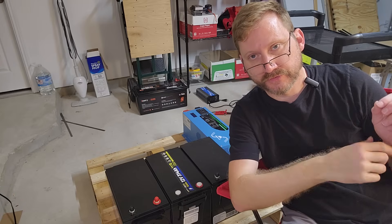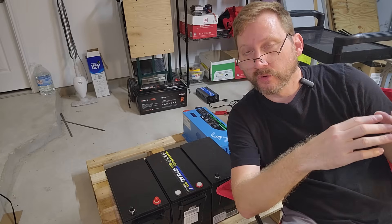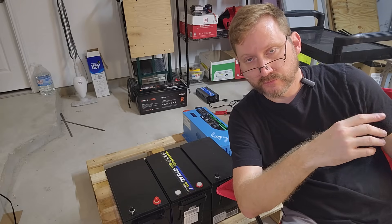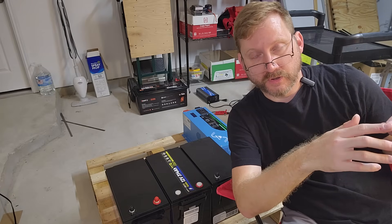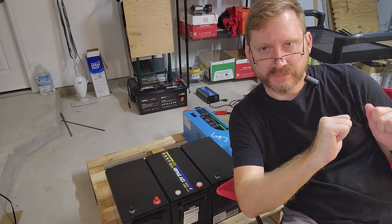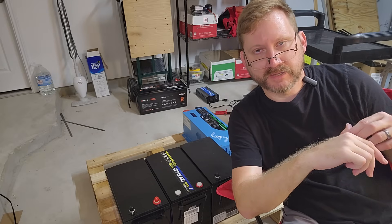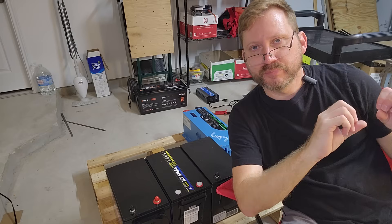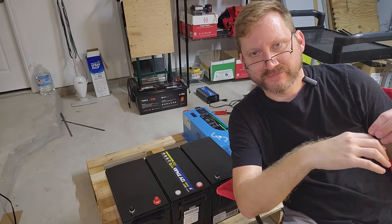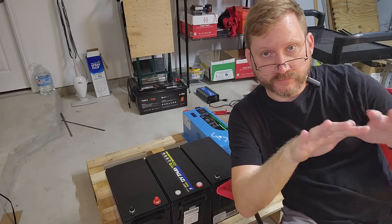I have a longer video on 12 versus 24. The reason why I don't go to 48 over 24 is a lot of automotive things like RV refrigerators will run on 12 or 24 volts, but they won't run on 48. Also the equipment is just a little more expensive for 48, but the big reason why I don't recommend a 48 volt system for a small to medium home backup is the minimum input voltage — you have to have for most 48 volt systems it's like 100 volts. That means you have to have a minimum of four big residential panels just to kick it on.